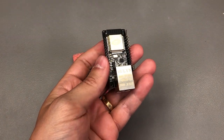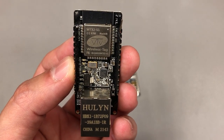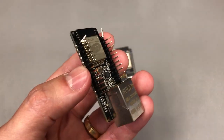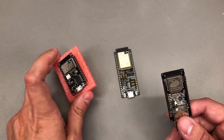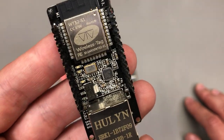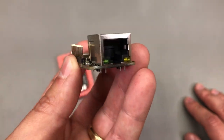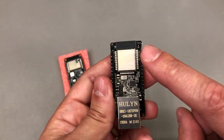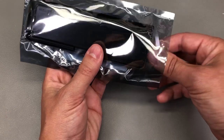I also didn't have an ESP32 Ethernet development board, so I found this cheap one. It uses a custom ESP32 module from a company called Wireless Tag, but I'm hoping it will just run as a standard ESP32 module from Espressif. The pins got a little bent during shipping because they didn't use any foam for protection, but that's an easy fix. The board uses the LAN8720A Ethernet transceiver, which is pretty popular and supported by many libraries, so it should be fairly easy to use in a project. It's not open source but you do get a fairly comprehensive datasheet for both the board and the ESP32 module.